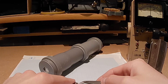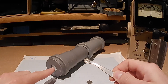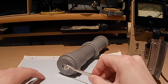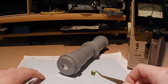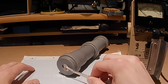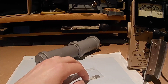One type of radiation it can detect from this source is the alpha radiation coming from the americium-241. So let's hold it up to this window here and see what happens. It immediately pegs the meter. I've now put it on the highest scale — it immediately pegs the meter again.